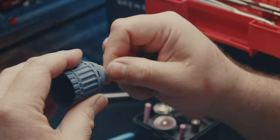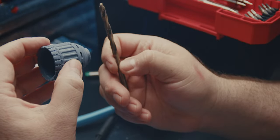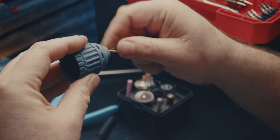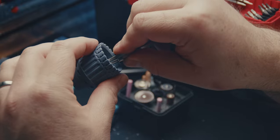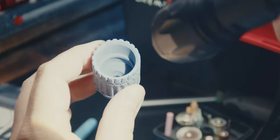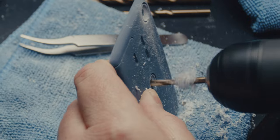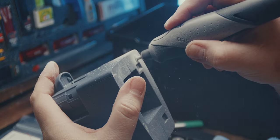Cured resin is inevitably brittle, even the ABS-like I'm using here, so using power tools can get tricky because parts tend to break if you're not careful. Superglue, however, is my new best friend because even though I broke a few parts, admittedly some more than once, resin responds quite well to superglue, and even the parts that I broke twice did not break at the glued joint the second time, which says it all about the power of thin, fast-curing superglue.